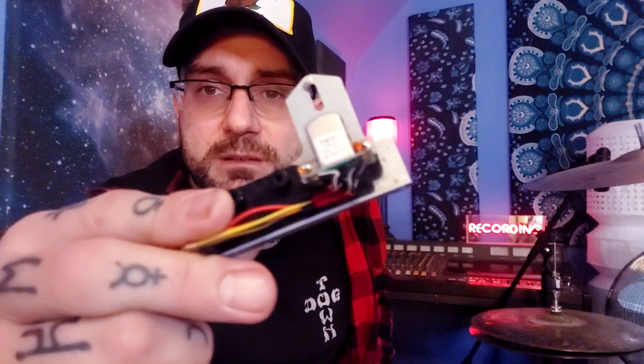I've said in the past that in my experience these things either work or they don't. Let me show you this a little closer to camera — this is the play/record head; it's common to the 244, 246, 234 and so on. You've got to imagine there's a little coil of wire wrapped around a ferrite magnet in there — well, there are four of them, one for each track. Then you've got this precision-engineered casing which prevents the magnetic field from the coil coming out except through four very narrow apertures. I think what happened in this case was that these apertures were blocked with the tar that rubber degenerates into. This job was done for a customer who had done a good job of replacing the rubber in the unit themselves based on my videos, but they hadn't done a very good job of cleaning up the tarry remains of the old idler tires and pinch rollers.